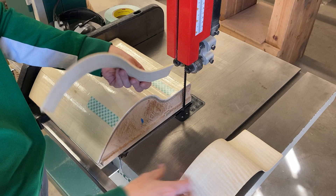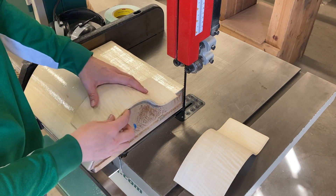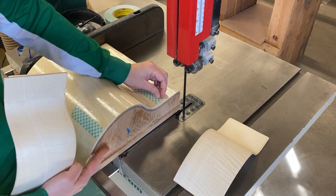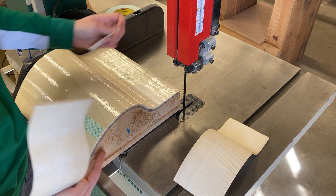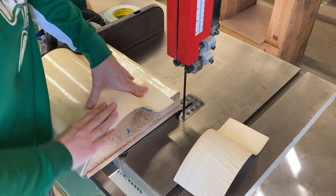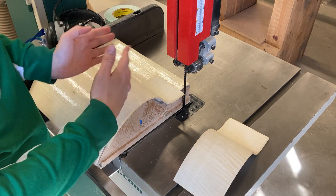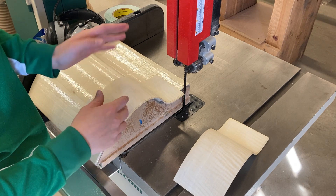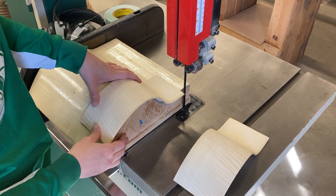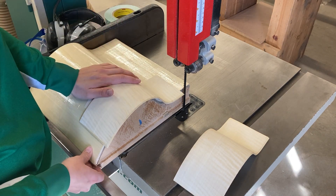I have here my two vase pieces and my vacuum mold, which I've repurposed as a cutting jig. I can either manually hold my piece in place and run it through the bandsaw, or if I'm worried about my hand slipping, I can add a little security with a couple pieces of double-stick tape and make sure the piece comes down flush with the surface of the mold. That way, even if the lamination became skewed and is no longer parallel with the sides of the mold — this one is about half an inch out of parallel — it doesn't matter, because I'm using the mold surface as a reference and the squareness of the edge on my mold to run against the fence.